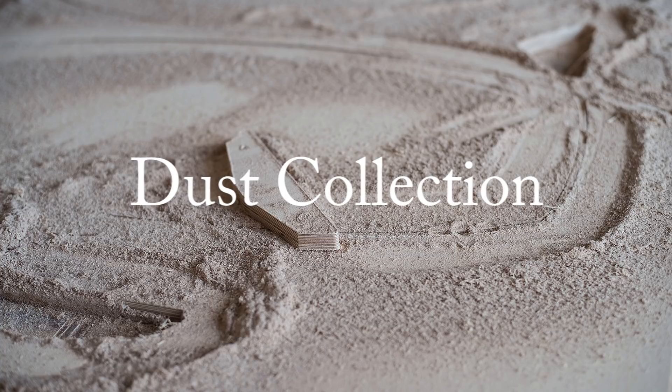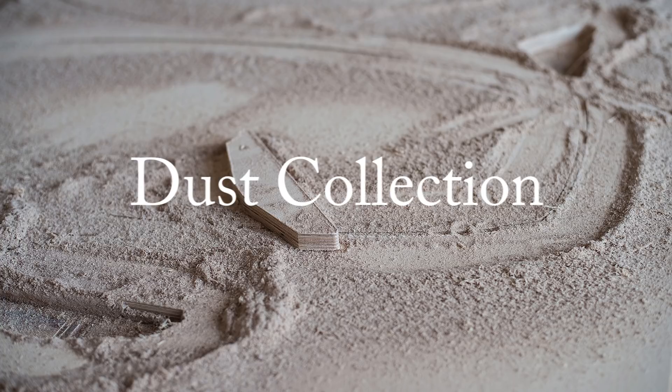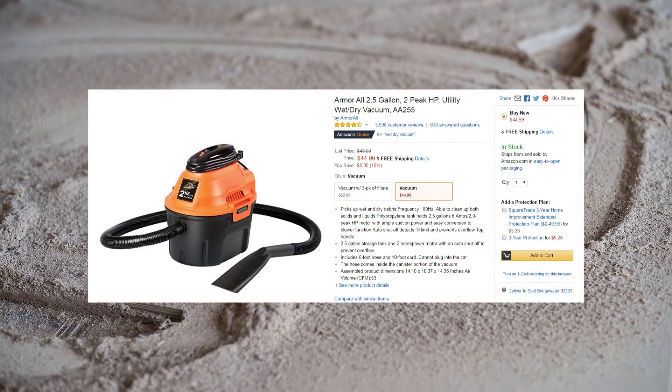Dust collection is important for cleanliness, but also health. Many woods contain known allergens, and it's not unheard of for woodworkers to develop allergies after years of exposure. There are two components to a dust collection system: the collection system itself, and the mechanism to collect the dust at the source. A simple way to begin your dust collection system is with a small shop vac. These small shop vacs are perfect for a new setup — the small size makes them easy to carry and store, they don't use bags, and you simply need to periodically empty and wipe out the interior tank. Even without other accessories, you can use the shop vac hose to clean up after a cut or carefully catch dust during the cut, keeping the hose and your hands well away from the cutter.